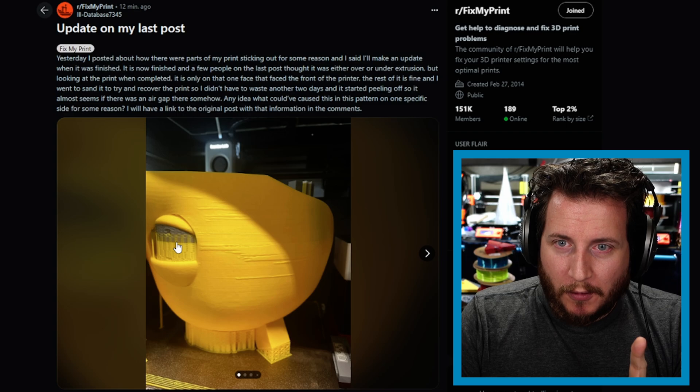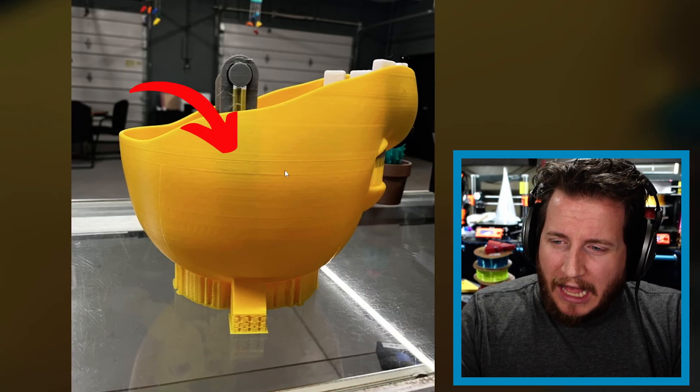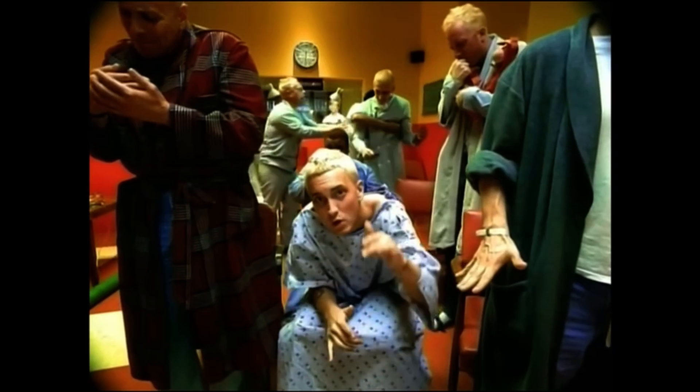The maintenance is what's tickling my attention. Looking at the additional photos, we can definitely see some weird patchiness in the layering. It apparently only happens on the front side of the print. There are a couple of lines that look more related to the color changing than anything else, and overall the rest of the print looks fine. My best guess is that during the repairs some screws were left loose, and potentially that hot end is wiggling ever so slightly. I also wanted them to check the hot end itself.